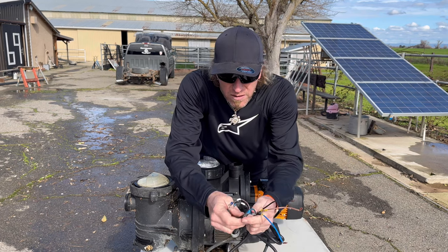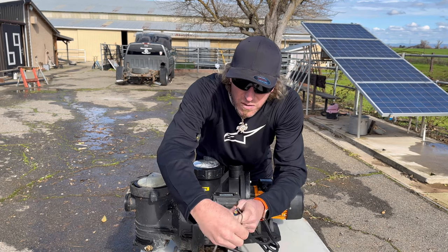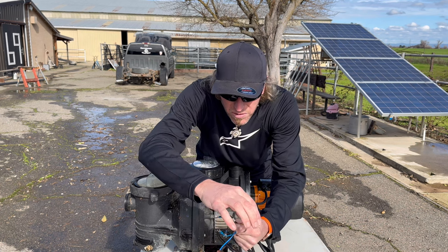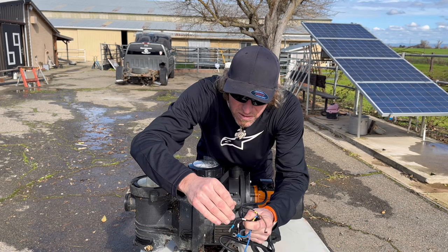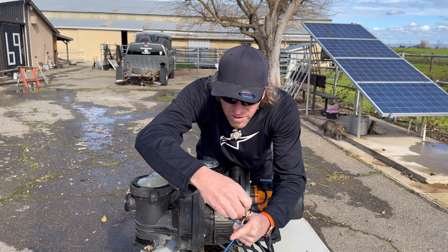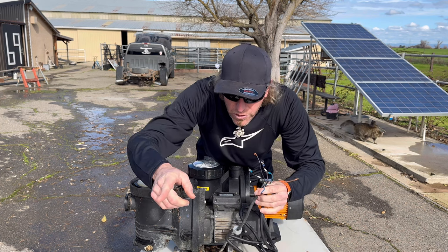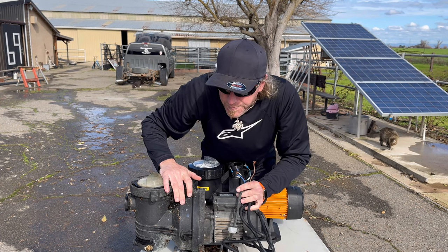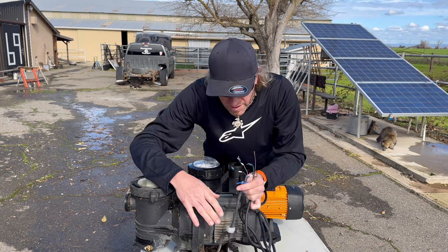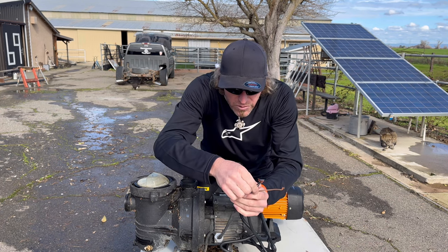They're both three wires. Let's see, the blue wire is a V, this blue wire is a V, so that's a win. This black wire is a U, that one's a W, so that could go either way. And then the brown is the opposite with a W and a U. So I got a 50-50 chance on wiring it up to the old inverter. I'm not using their inverter. I'm gonna try it with the old one so I don't have to rewire it, and all I have to do is make three connections and go, and I'll relabel the new ones.